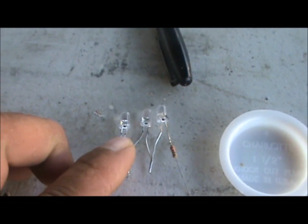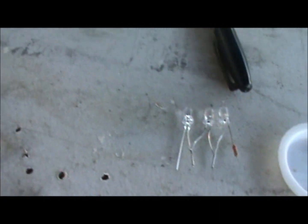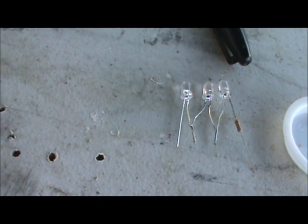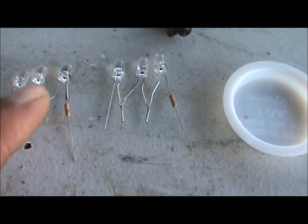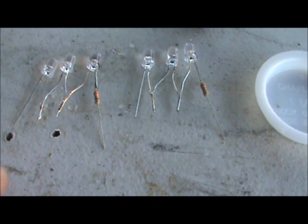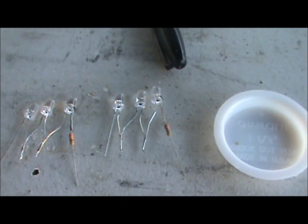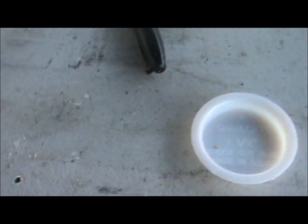It's time to start the second part of the LED build, and that's making the floodlights. I filmed some of these a little earlier when I was doing the LED project. I had taken three LEDs and soldered them together. I've already gone through all of them and got the appropriate resistors mounted on them. My next step is to get the leads soldered on as well, which I'll probably be doing in a day or two. I decided to take a break from soldering to work on these.